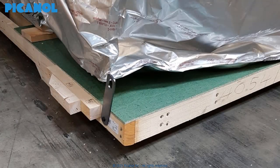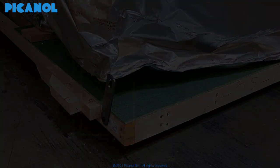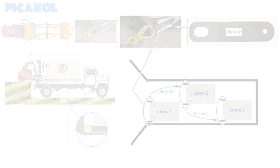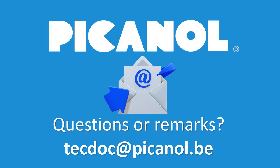When the customer did not order the towing hooks and towing cables, the looms have to be unloaded by means of pulling plates, steel cables, and a forklift truck. One set of pulling plates is mounted on the wooden floor of the first loom in the container. Work in the same way to unload the machine, but with the pulling plates instead of the towing hooks. Questions or remarks? Please contact us.